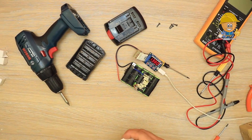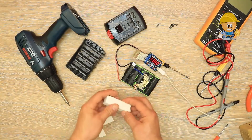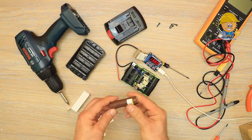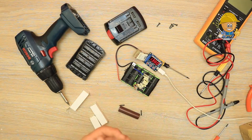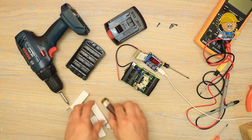We have about 1400mAh, but that's not good enough. To increase the viability we'll put in LG HG2 cells, with a nominal capacity of 3000mAh and continuous discharge of 20 amperes, which you can find in the description on my blog.